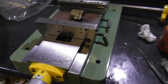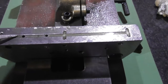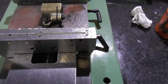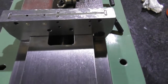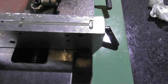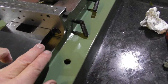What I have noticed — these oil ways here, if you can see them, all down there — they're quite sharp and don't allow the oil to come over the top and onto here to get in contact with the bed. So it would just be sitting in the groove and you'd probably get a little bit come out. But anyway, it's all been cleaned up. All these edges are nice and clean.